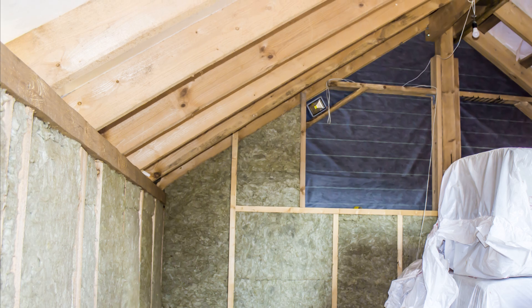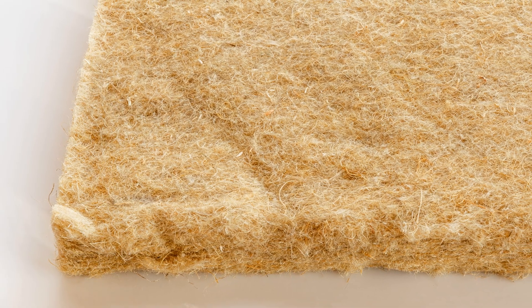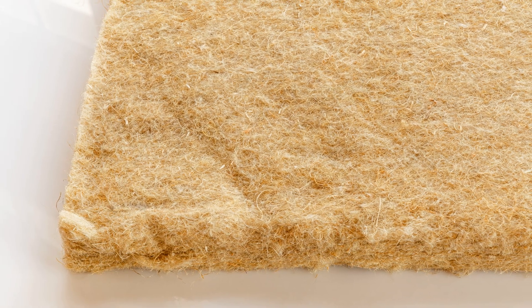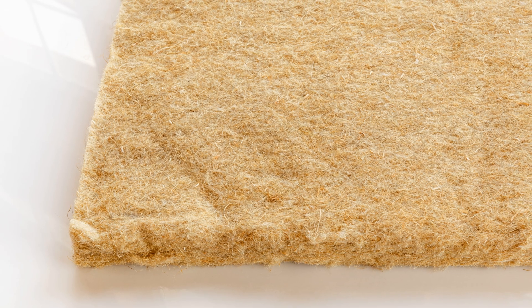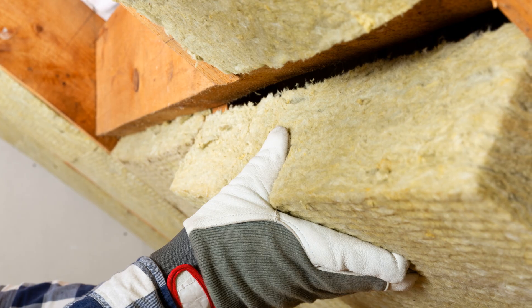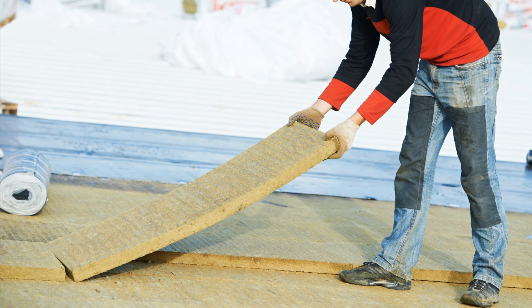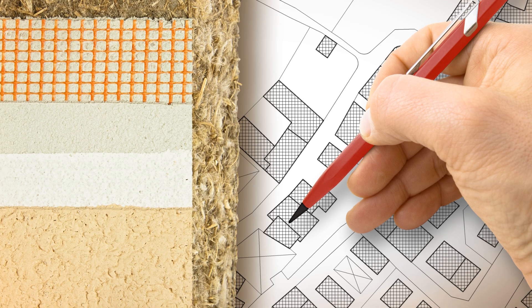As long as it's kept dry, that's really what matters. Hemp being a natural fiber is a lot more prone to mold growth — mold wants to grow on anything organic it can eat. Just like wood fiber insulation, you have to be a little more careful. Same with cellulose — all these materials are treated to remove what mold wants to eat, adding paraffins and other things to resist moisture. Hemp fiber is going to be relatively vapor-open and probably air-permeable, which means you need an air barrier or install it on the outside of the sheathing.